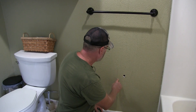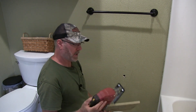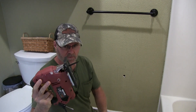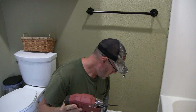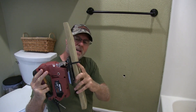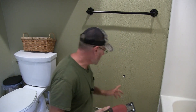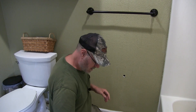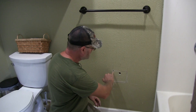I'm going to cut out a section here — a square — and we'll go from there. Nothing fancy. I'm going to use the jigsaw, but this jigsaw blade goes pretty deep and I don't want that. So I brought the blade out as far as it'll go and then I'm going to lay a board against it so it only comes out a little over a half inch past the drywall. We don't want to go in there too deep — always better to be safe than sorry.